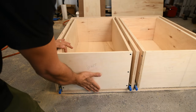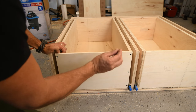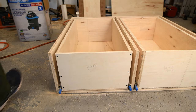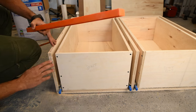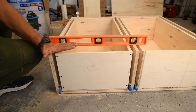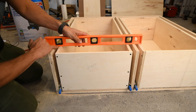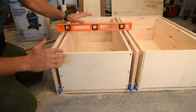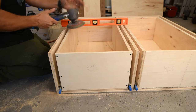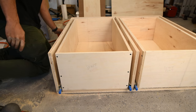With all four slides in, everything's flush and looks good. On the sides I had to add a few small one-eighth inch particle board shims to move things into the right spot where the gap was a bit too large. Also, make sure your drawers are slightly smaller than your actual box — leave a decent gap on the bottom so they don't catch. Take a level or something flat and run it along to make sure you have a little gap. If your drawers slide along the top of your box and catch, take a sander with 60-grit sandpaper and bring down that edge. You want about one eighth of an inch gap all the way along.